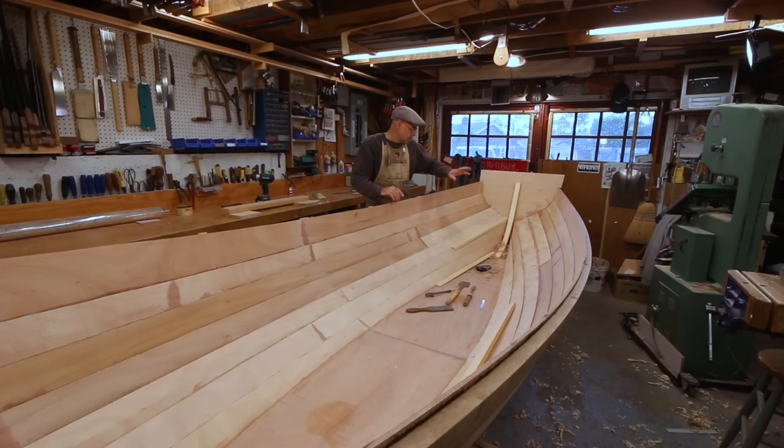If we recall, these two planks back here, as you hit the transom, it's just this little skinny butt joint that's only as thick as the planking itself, which is just a quarter inch. So it's a pretty weak little joint back in here. It's probably okay. And if you'd put a big hefty fillet on the outside, it would be just fine. I didn't do that because I wanted to keep it looking a little more traditional outside by not filling out these plank seams like that. So I'm going to bulk it up on the inside.